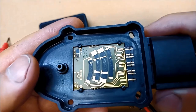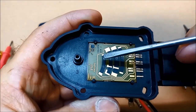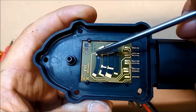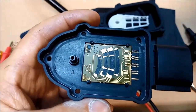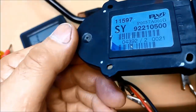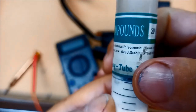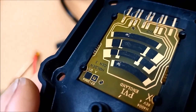There's not much we can do with that unless someone could let me know how we could put a thin coating there that would not allow a circuit going through — only when those little sweepers touch on those points. This one's basically buggered unless we could find a way to coat it somehow. Another reason why they probably wear out prematurely is because they're dry. If they only used a bit of conductive grease or heat sink compound, that would have allowed those sweepers to not wear it out prematurely — it would last a bit longer.